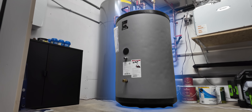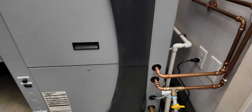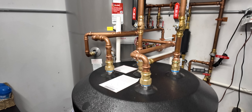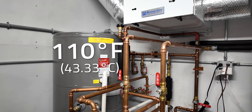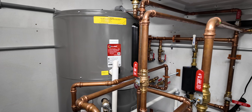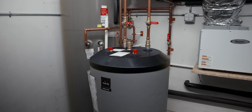That little mini-me tank sitting next to the Rheem is why. I have my water heater tied into my geothermal HVAC system that's heating and cooling my entire house. The excess heat from that system's compressor is captured into water that sits in that tank waiting to be used by the Rheem water heater. That means our Rheem isn't refilling itself with cold water straight from outside — it's refilling with water that's probably already over 110°F. After the geothermal desuperheater was hooked up and working, I noticed that the mechanical room isn't meat-locker cold anymore, but it's still cool.